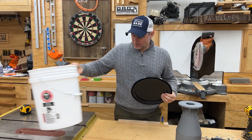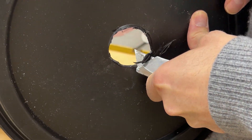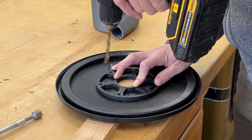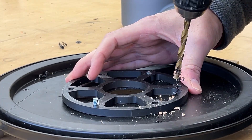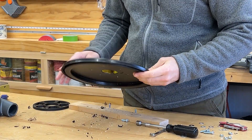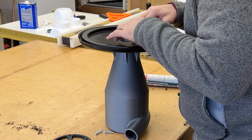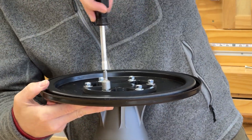You're going to need a five-gallon bucket with a lid, and what you need to do to hook this up is create an opening large enough in the middle of the lid to accommodate the hole at the bottom of the cyclone. I also printed a reinforcing part that installs on the opposite side of the lid to give it some strength. I'm also using silicone to create a perfect seal so no fine dust can get out. All the files shown in this video are free to download, including the parts I created — links are in the description below.